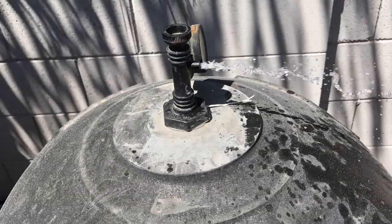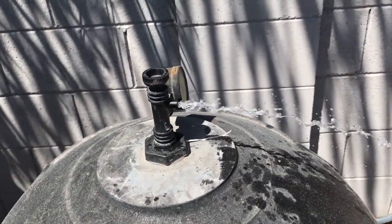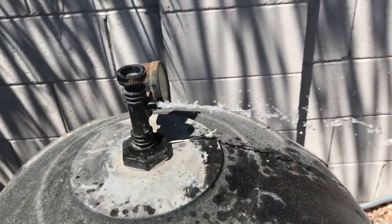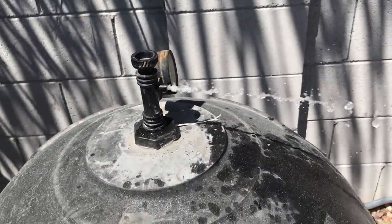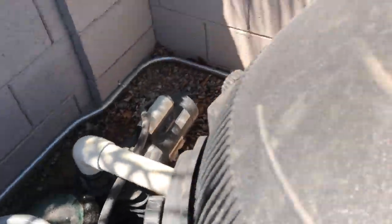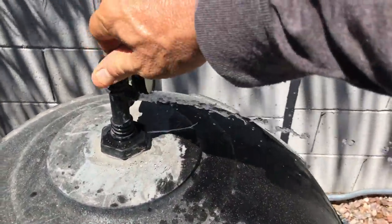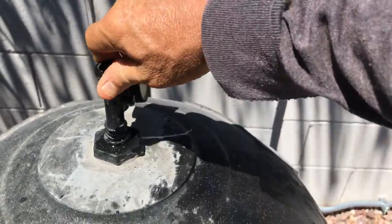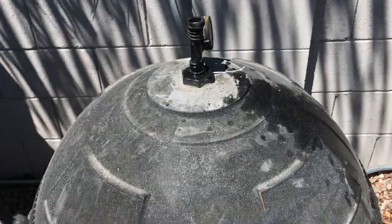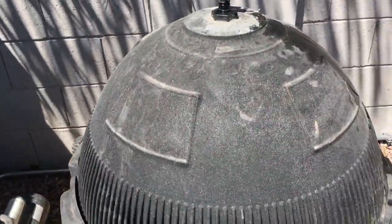I actually did not have you watch this whole thing fill up, because it took close to 5 minutes for it to happen. So just know that with a little hole like that, it's gonna take a little bit for the thing to fill up. So just be patient and watch for it. As long as your pump has got water in it, then you know it's filling up. Now all I do is I close that down, snug it down, don't crank it too tight so it doesn't drip, and I'm gonna inspect my filter for leaks.